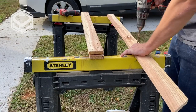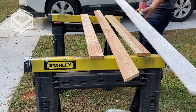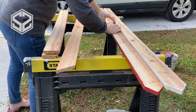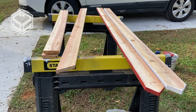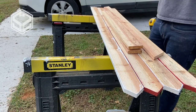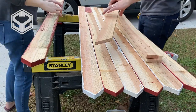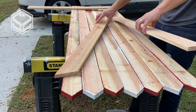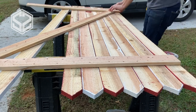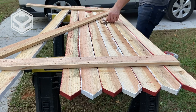As the pickets are drying, I'm going to pre-drill holes for screwing all the pickets together from the back side. We're using two vertical pieces going from top to bottom at three feet on either side, plus a longer piece going diagonally — this keeps the whole piece from racking and one side sagging more than the other. We'll attach everything with one-inch screws that go through both boards without poking out the other side, putting two screws on each picket at the vertical and diagonal pieces. Before screwing everything together, make sure everything is laid out square or it's going to look pretty wonky.